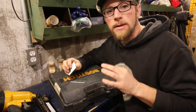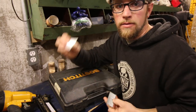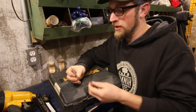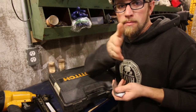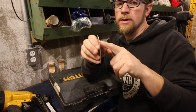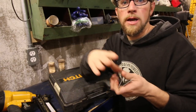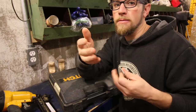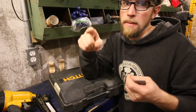When installing our wood flooring upstairs, I used the finish nail gun — they're a more rugged nail versus the brad nail. So they each have their give and take; you'll use one for one application and one for another. If you're working in hardwood and you're afraid the nail will move on you, use the finish gun. We use a lot of soft wood for trim work, so we use the brad gun. If the nail hits a knot, it can deflect — so be careful where your hands are. Remember your nail can go one way or another.